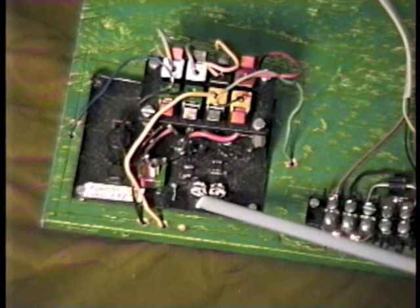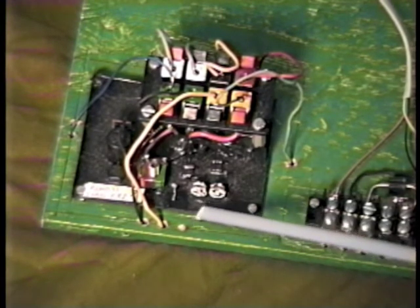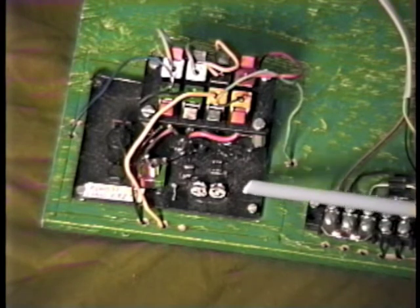One advantage of this eye control unit compared to magnetic blocks: it doesn't have any track contact T2. This time delay essentially replaces track contact T2. The other advantage is that it may be a little more resistant to outdoor weather, dust, and dirt than the mechanical parts. There's no track contact T2 needed, which simplifies the setup.